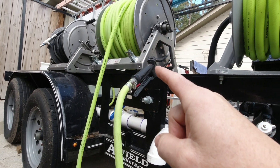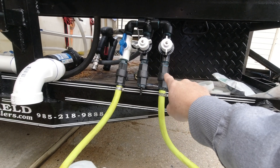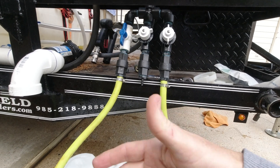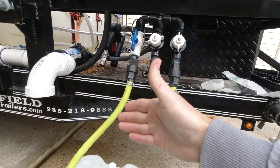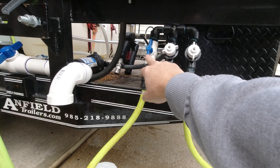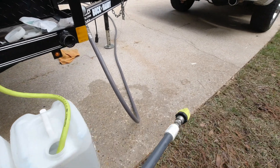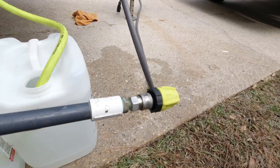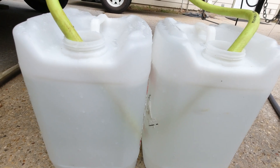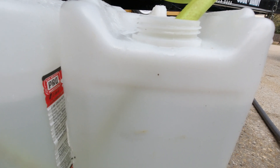The purpose of this test is to see if the water draw through the ball valve is going to be the same as through the Pentair metering valve, because when you mix chemicals the ratio needs to be as accurate as possible. We're not building rockets here, but if there's a dramatic difference I'll put a Pentair valve in. The water valve is fully open on the ball valve side, and the SH knob is also all the way open. I'm going to hold the gun and watch the water levels draw down.